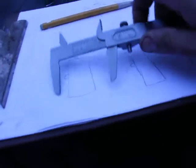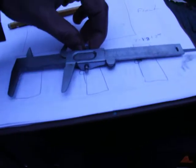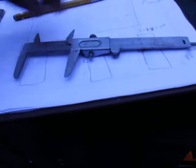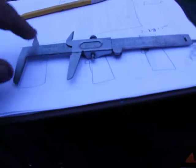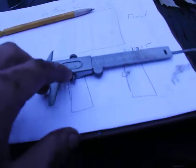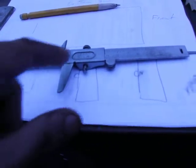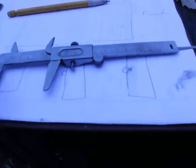So if you just close it, both of the smaller scales, or on the vernier scale, they're just 9/10 of 1 unit on the main scale. So for the centimeters, bottom one, there's actually this complete 10 divisions here. It's actually exactly 9 millimeters long, right? And for the inches, the entire scale, it's 9/10 of an inch.